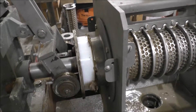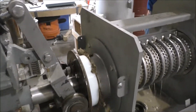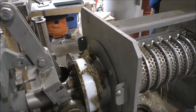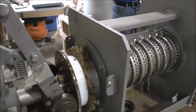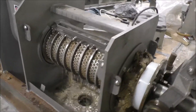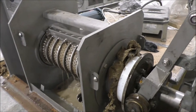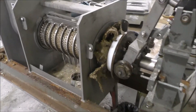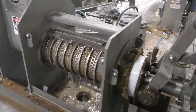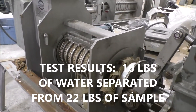It'll open. It'll keep coming out all the way around the cone rather than channeling out one side. It's low air pressure — you can see that. A little bit of a mess. We're catching the liquid and the cake, and we'll weigh these. We'll at least get a split of what percentage is separated. I'm not trying to get a capacity test here in kilos per hour.